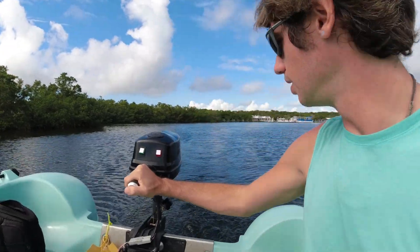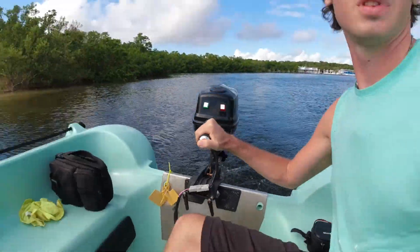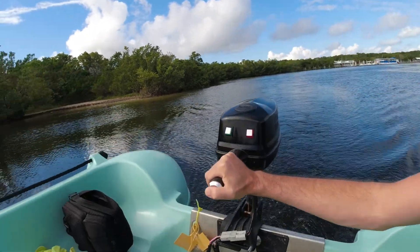There's definitely some saltwater corrosion going on — a little bit with the paint on the actual motor. The actual motor is underwater, not in the housing above water, similar to how trolling motors are usually underwater too. The 1 kilowatt version is not made that way — it's a normal lower unit sail drive with the motor on top. I think for cheaper motors that might be better, because the less you have in the saltwater, the better. Less corrosion, less issues, less water damage.